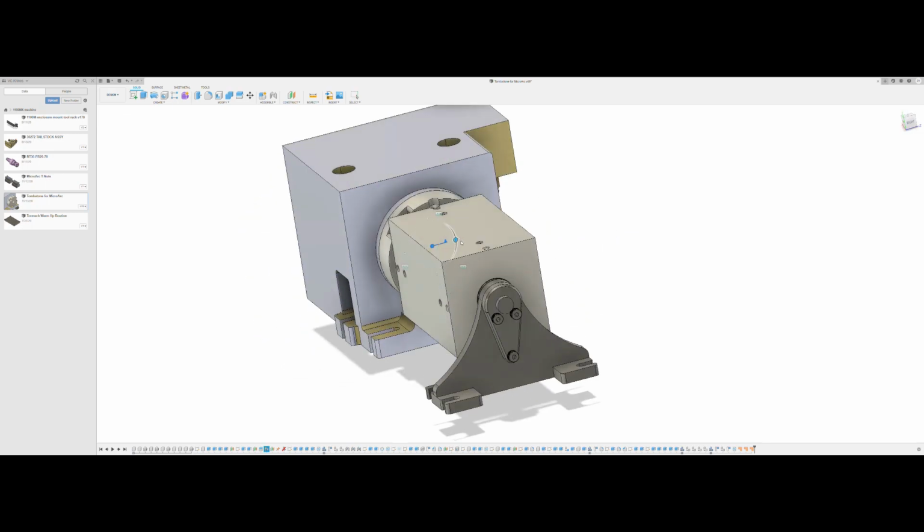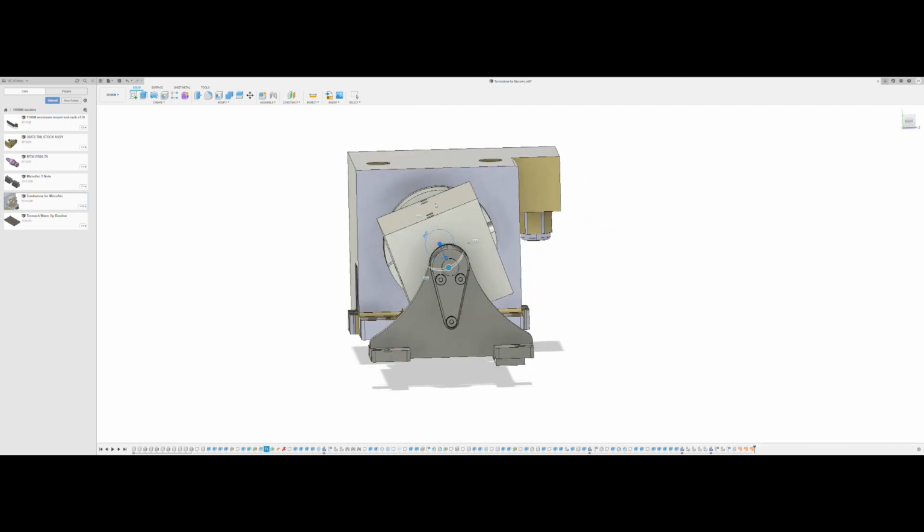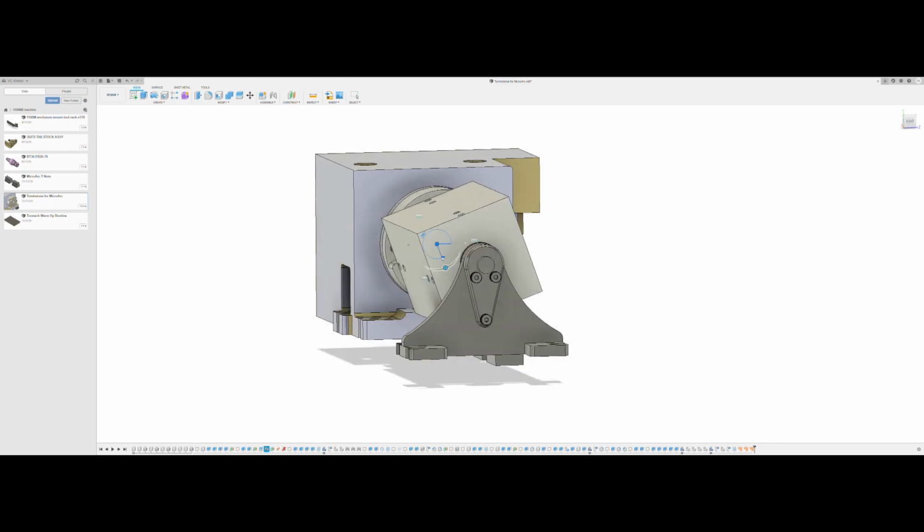You can see how this will work while it's on the machine. As I do one pallet, it can be used as a positioner to move it to the next one, then to the next one, then to the next one. And also, if I get a little more advanced with some things, I can tilt it so that with some of the end mills that come straight down, I can machine parts at an angle. I'll try that at some point, but probably at first, just use it as a positioner to get pallets lined up.